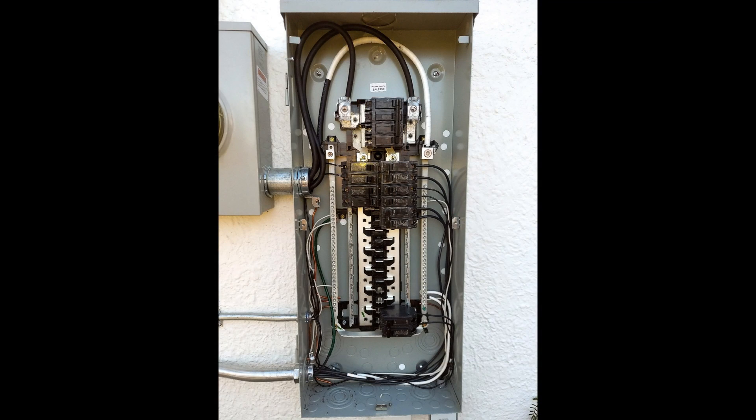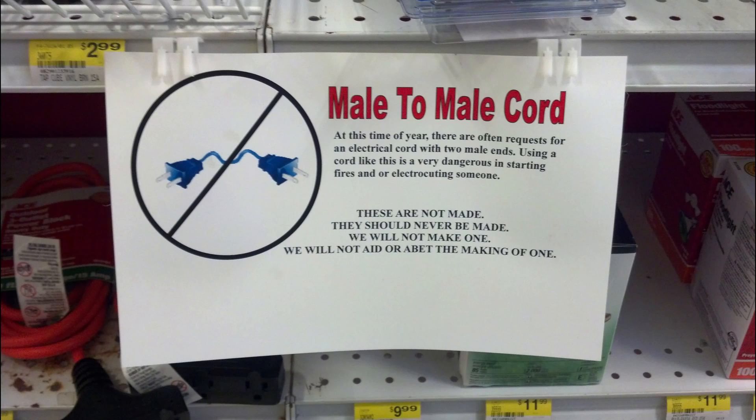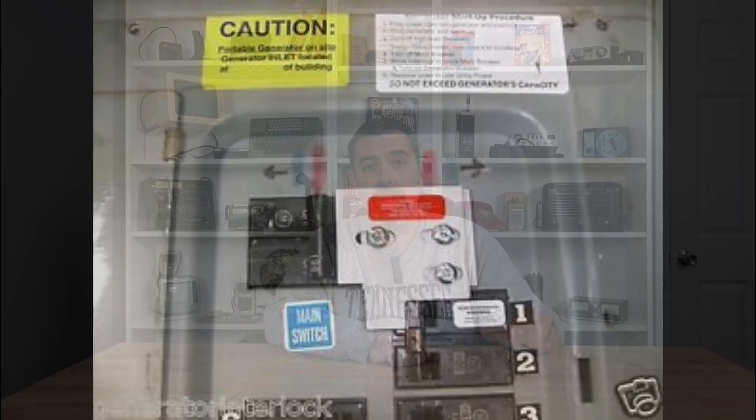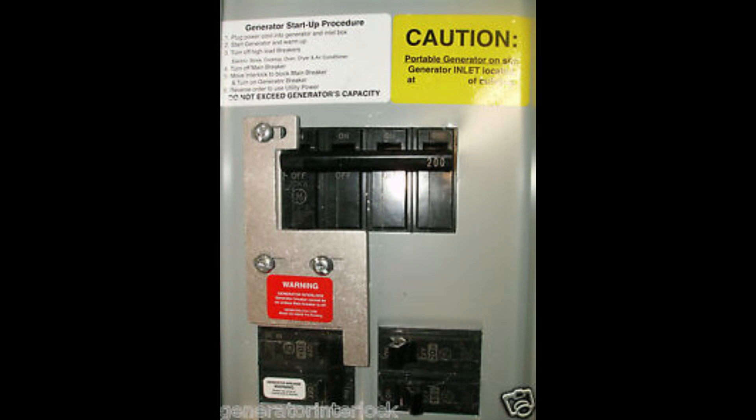They also have different phases. Regular household current in a house is 120 volts. If you're just going to be running a few items — like our original setup, which is 1,200 watts of solar with a 2,000 watt inverter running four or five outlets on one side of the house — that works fine. But if you want to run a well pump, it's important to have what's called split phase wiring, and that adds a lot of cost. Getting an inverter that offers split phasing means you have two legs of 120 volts, giving you 240 volts, and you're set up to hook up to what's called a transfer switch — something I'll get into in the next video — that allows you to move circuits on and off the grid as you need them.